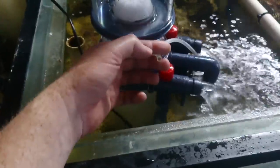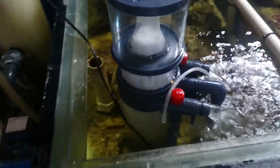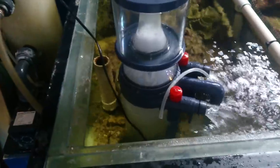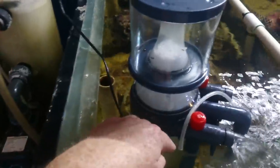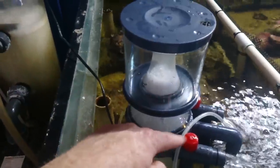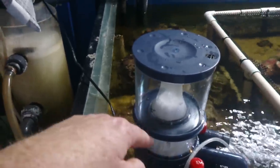The air gets sucked by a venturi into a pump. The pump sits in the aquarium itself — this is a particular hang-on unit which you could either use as a hang-on or submerge within a sump, no problem. Then the water goes into a venturi, the air goes into a venturi, and the water goes into a vortex which spins up around.